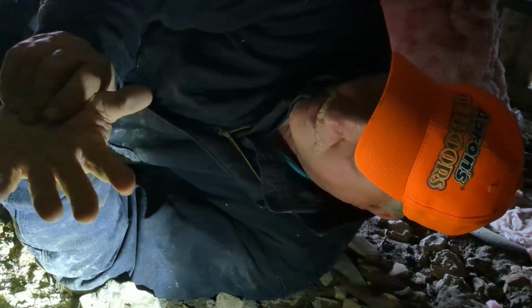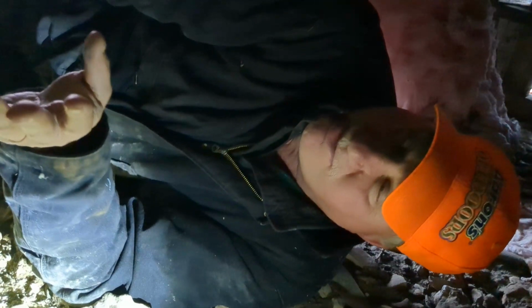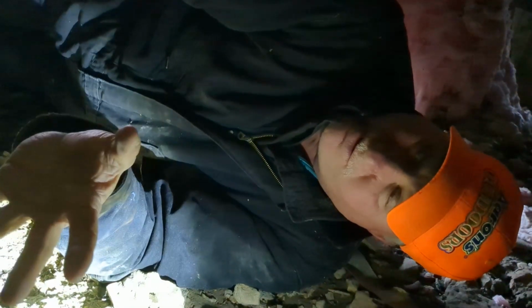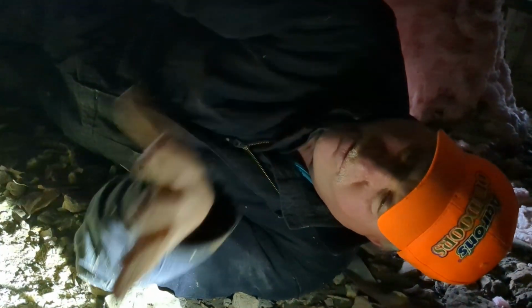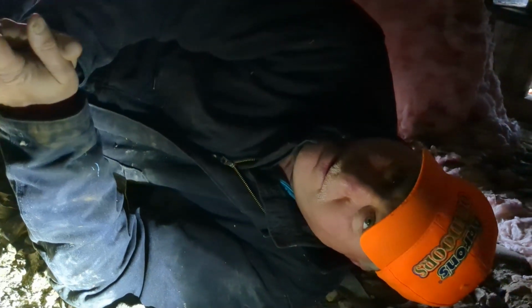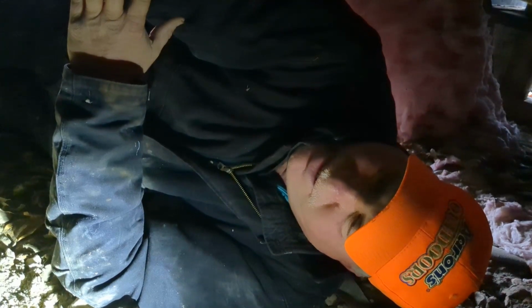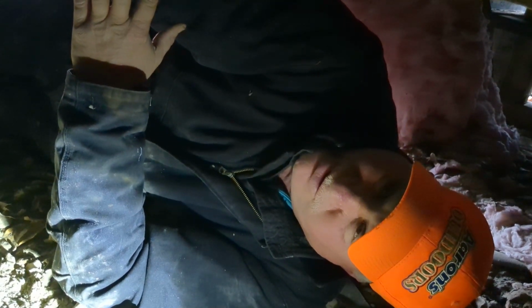How do they do it on a double wide? A double wide, they end up cutting out a section of this. And it does something similar to this, but the pipe loops over from one to the other. And you would use flexible if they're setting it up new, and then eventually you end up going to a metal hard ductwork and then run insulation on the outside of it, trying to keep it off the ground so it doesn't get moisture to it. That's called a crossover, right? That's a crossover ductwork, and usually that's directly underneath the heater, the central heat unit, which is usually inside.